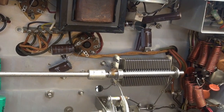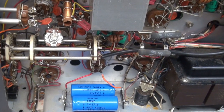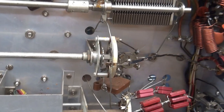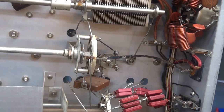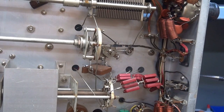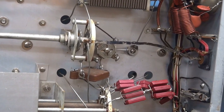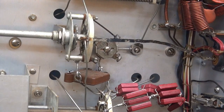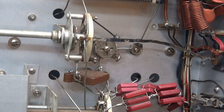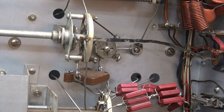All right, we have the electrolytics all installed. High voltage section — safe to operate again. Now let's take care of those cold solder connections off of the coupling switch. The best way to do that is to take a little bit of solder wick and remove that old solder. You don't want to leave that stuff on there. So we're going to grab some solder wick — I'm going to suck off the old and put on some new.